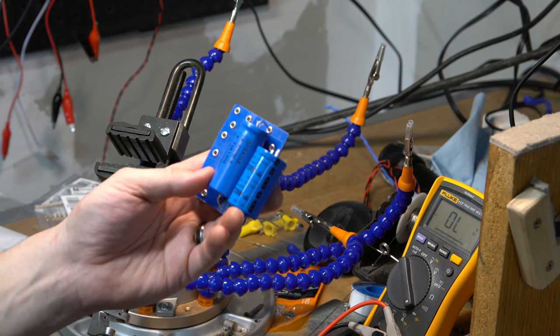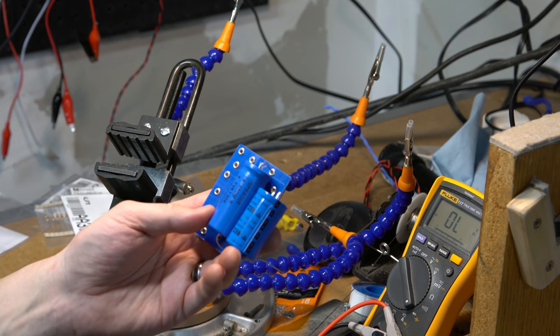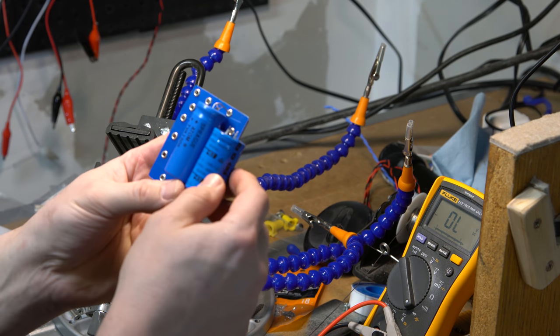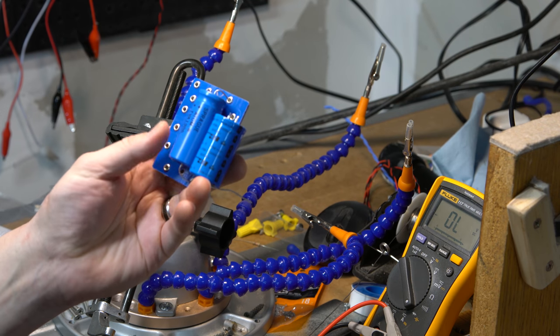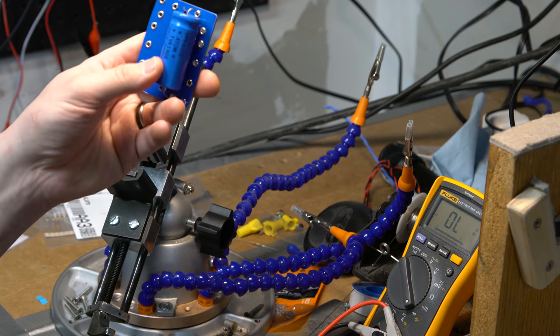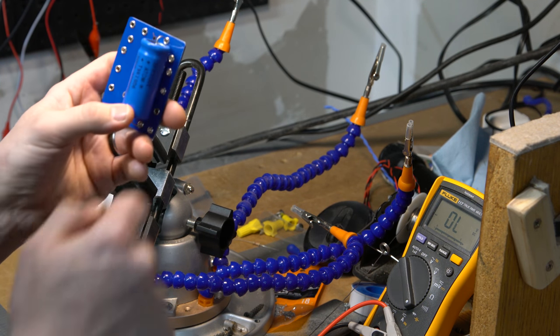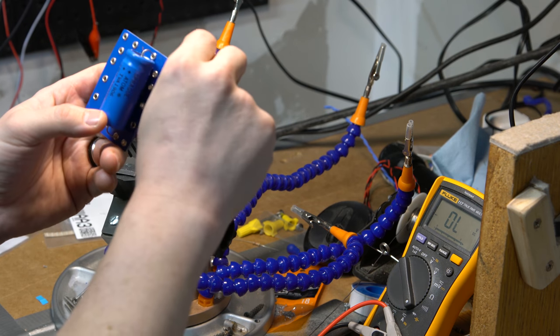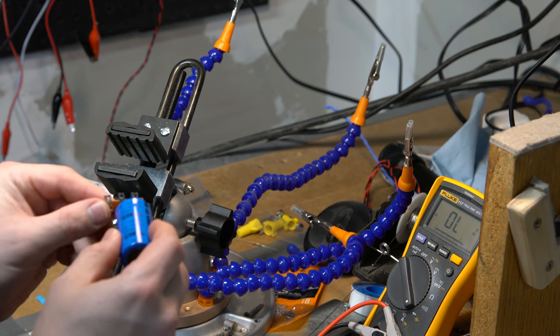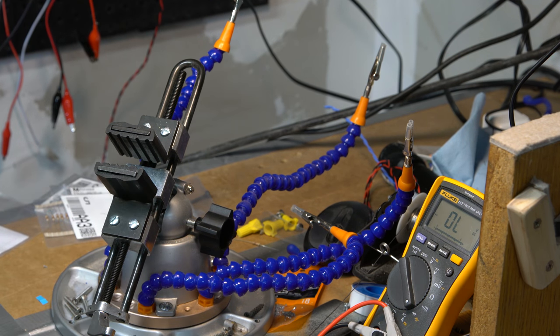Well, the amp I've got, I checked the voltages in the 400-ish range unloaded with the power supply, nearing 500, but not exceeding it. So I got a 500 volt capacitor at 150 microfarads. That's the same rating. And then I'll put a 270K bleeder resistor across it. But I've been trying to decide, I could use this board that I kind of made extra anyway and just slap this next to it. Or I've also got some extra of these types of tag boards or terminal strips. I could just put one of them that has multiple leads on it, and that would make it a little easier. So I've got to kind of figure that part out. That will be one of my next steps. I'm gonna have to think that through, but that will probably be on the next video.